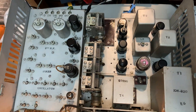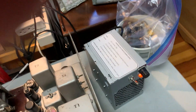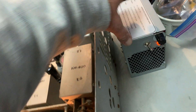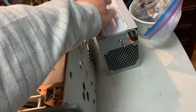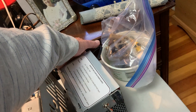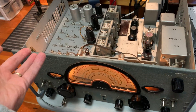It's quite a well built set, really strong in terms of mechanical construction, and a very reliable set. It's running off a homebrew power supply — this is the power supply I built last week. I built a few of these little power supplies into old computer power supply cases. It's got a mains transformer, filter choke, a few capacitors and a couple of resistors. I left the computer fan in so it keeps it nice and cool — it's running off about 8 volts instead of 12 volts, so you can't hear it, very quiet, but gives a little bit of airflow through the case.